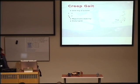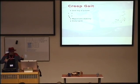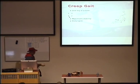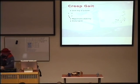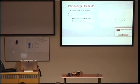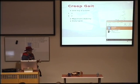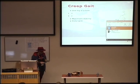And the speed depends on the so-called duty cycle. So duty cycle is the time between moving each leg, basically. And you can speed up, you can move even faster by moving not one leg at a time, but, for example, two legs at a time. The problem with that is that if you raise two legs, only two legs remain on the floor, and you are not statically stable anymore. So the trick is to do it very fast.